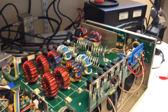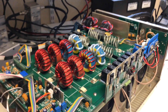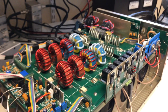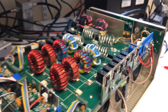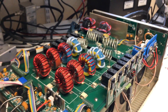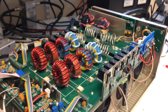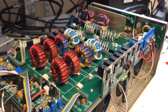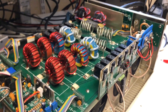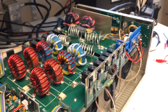So, again, earlier model ALS1300. It has the older RF boards — none of the surface mount technology like the 1306 has. So, kick it on. The fans will start up at about 9 volts, maybe a hair above 9 volts. Hopefully you'll be able to hear everything. I've got the monitor tone on the K3, not too loud, but I wanted you to be able to hear that in relation to the relays. This will give you an idea of how loud the relays are with the cover off — it's even better with the cover on.